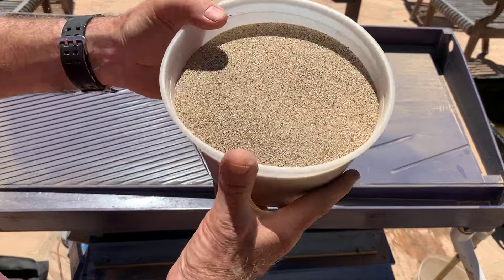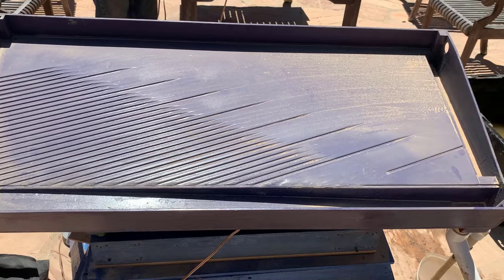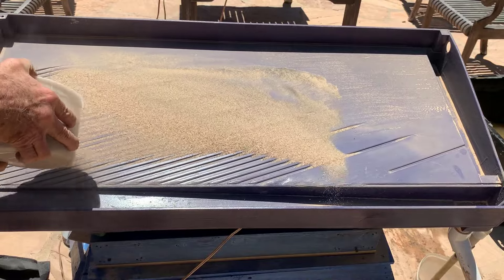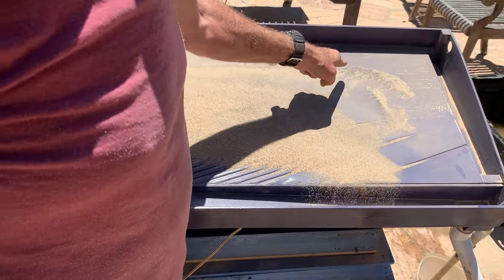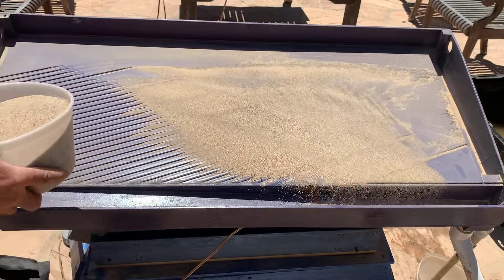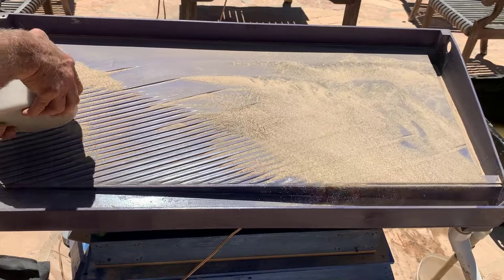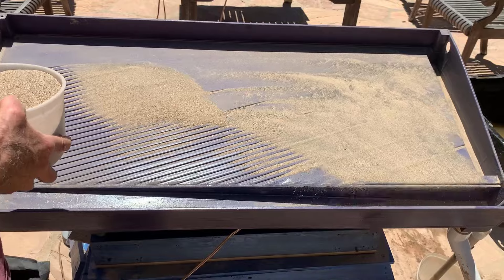I've got approximately three kilograms of starting material screened to 20 mesh. I've got the machine turned up all the way — six and a half Hertz and one hundred percent. I can tell I'm going to need more power or less weight. There's a line of black sand coming over and another bit there, with a nice line of black sand coming out of the first groove. It behaves a lot like when it's wet, except the slope, rate, and everything are different. There's some print-through from the magnets, but I'll get rid of that in the future.